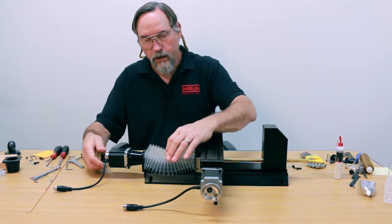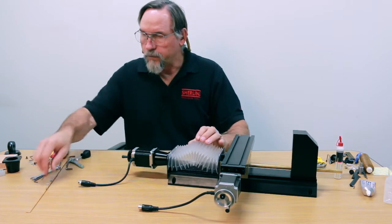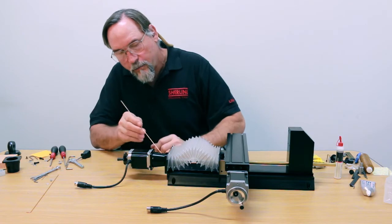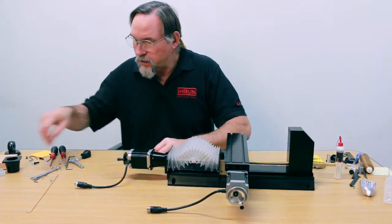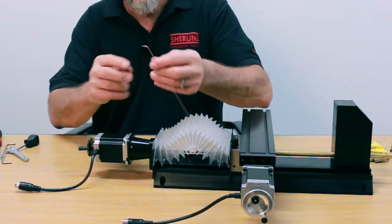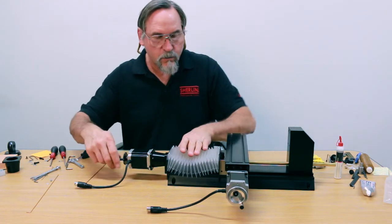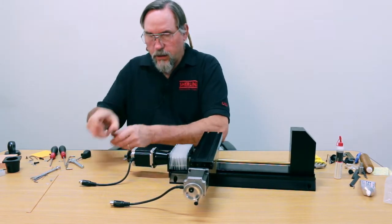What we've done is drilled all the way through the accordion cover, and then we have these two rods. If you look at the holes on the back here, this top hole to the right is for your rod to go through. This hole down here next to it is for a self-threading screw and washer to go into, because the end of the rod is bent — so when it's all the way through, it will be up against it, and the washer will hold it in place so the rod doesn't come out. It's easiest to put this through with it in the closed position, and then you can just fish your rod through.